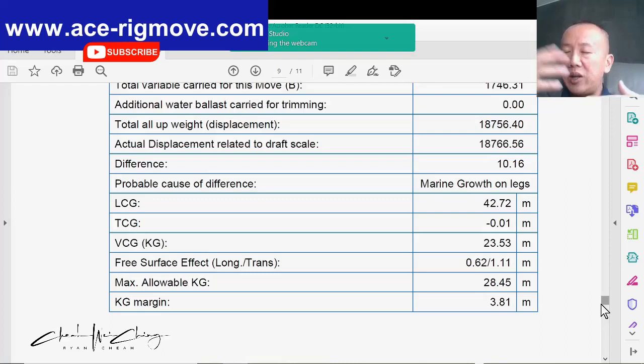And on the other hand, we can't verify whether the tank is leaking or not. The moment you put mud in the mud pit, if there's a minor leak, we don't know, because the watertight integrity check is sometimes only about 2 hours, so we can't see whether water is coming in, especially if you're going for a long rig move, and it's going to be a problem for the crew on board. We noted the leaks getting worse and worse and worse along the way. The mud pit is always a problem, remember, and the bulk tank.